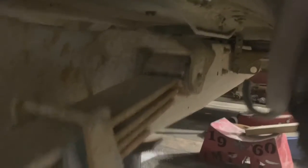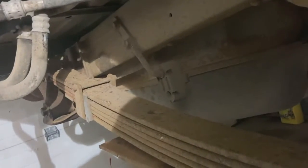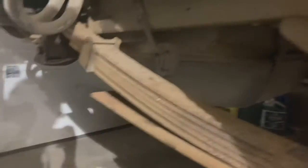Look at that! If I can just spin the whole bolt from the inside of the frame — that actually worked really well. I realized I should stop because I was laying under the leaf spring. Now that it's got that under it I can finish pulling the bolt out, then it can swing forwards and I can get the bolt out of the shackle, and the whole leaf spring can come out.